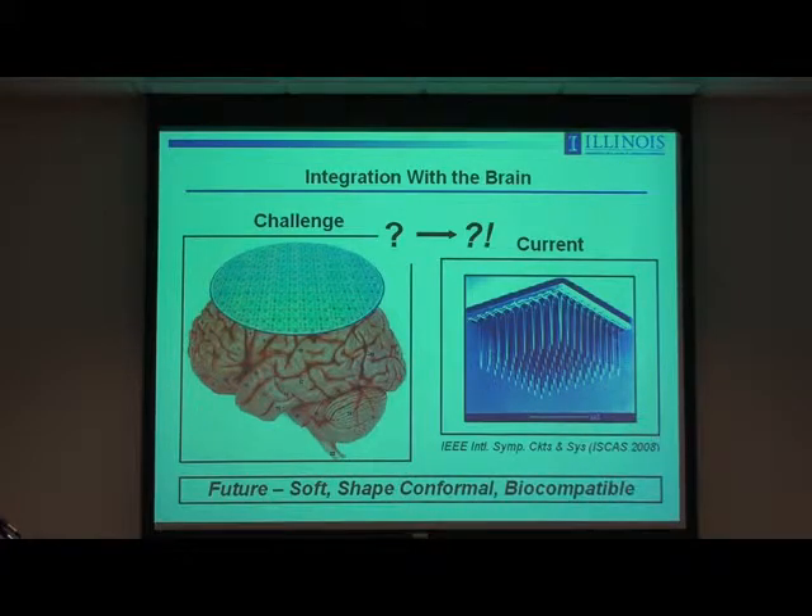The silicon wafer is rigid, flat, brittle, and planar, and the tissue is soft and curvilinear. In particular, the modulus of tissue might be a kilopascal, and that of silicon is 100 gigapascal — so you have a huge mismatch. What people do today — a technology that's been around 15 years or more — involves essentially a flat platform where you mount silicon electronics terminated in micromachined pins that penetrate the tissue of the brain to accommodate the curvilinear surface and provide the electrical interface. Although that can be good for certain kinds of tests, it does not form the basis for a long-term viable interface between the electronics and the tissue.